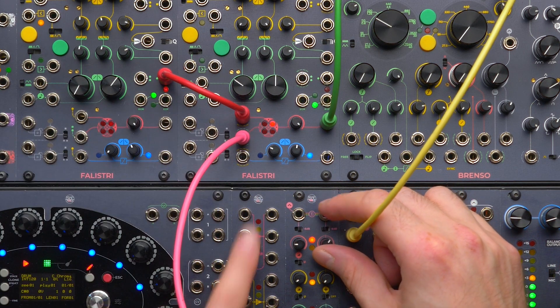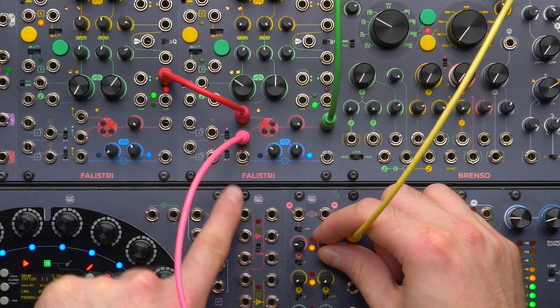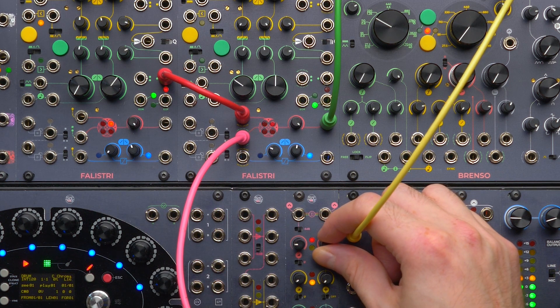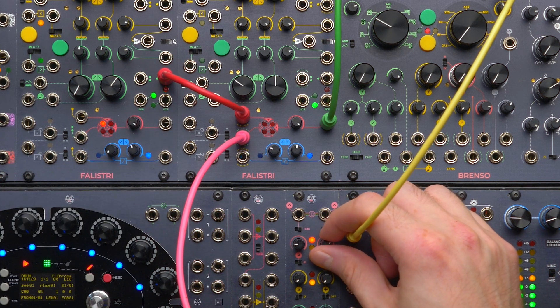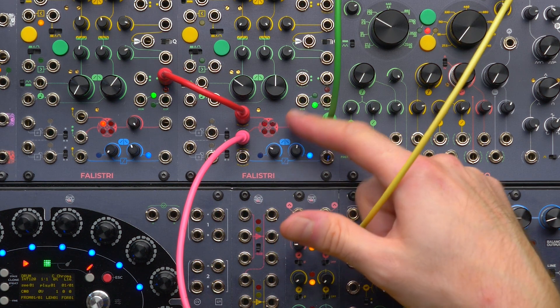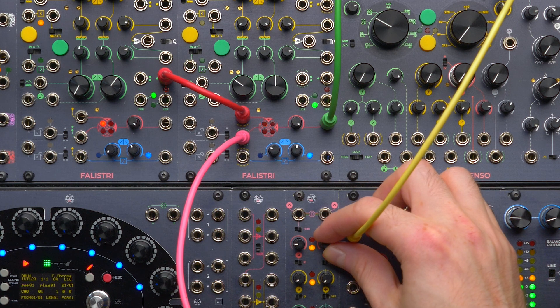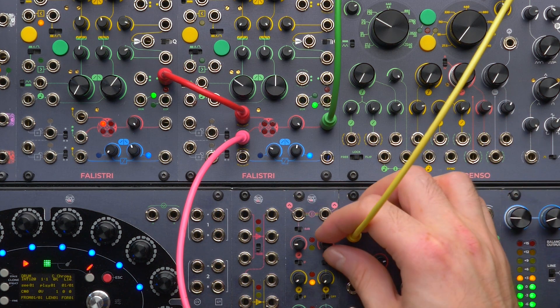You can see that now this LED is flashing, and now this one with the plus and the minus. We are using two quadrants because we are multiplying a unipolar signal by a positive or negative voltage, and here we have a visual cue of which quadrant is in use — whether our signal is positive, negative, or both in case it is bipolar.